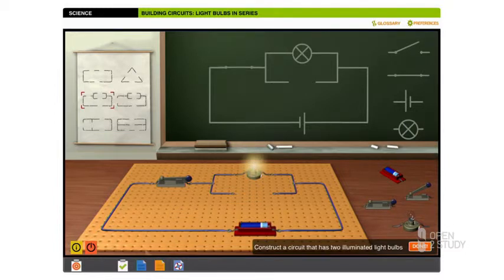Of course, what we really have here is a series circuit with a couple of dangling wires. It's not really a parallel circuit until we add in our second light bulb parallel to the first. Now we can see that we do have current flowing through both branches of the parallel circuit. What happens if we now add a third light bulb in series with that? Well, it happens as we expect from the previous topic. When we add something in series, we increase the resistance and we reduce the overall current that's flowing. But what's the effect of those light bulbs being added in parallel? Let's take one of them out again. Interestingly, we didn't see much of a change in the glow at all. Maybe adding something in parallel, or taking it out from parallel, adds differently than adding things in series.